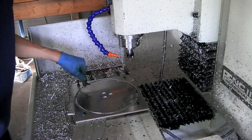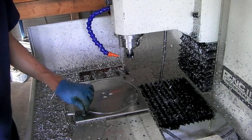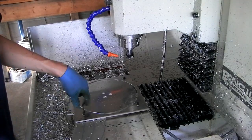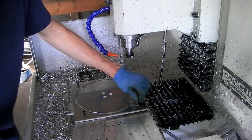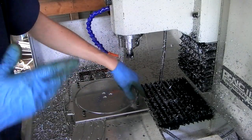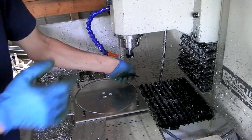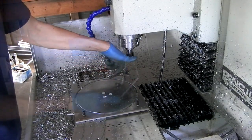It's another thing while machining that I've really picked up in the past 6 months, no, probably a year, is having an air hose, having the compressor on all the time, always pumped up. It's extraordinarily helpful for milling. Not only does this machine require it because of the power drawbar, but just for blowing the work off, for cleaning the table off, for blowing out holes, for everything. I use it all the time.